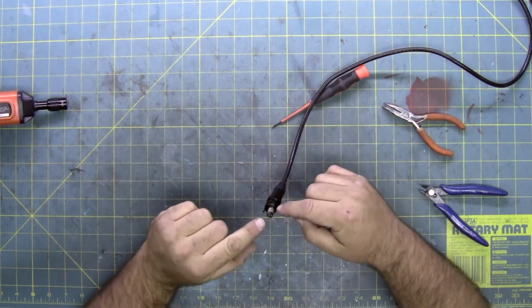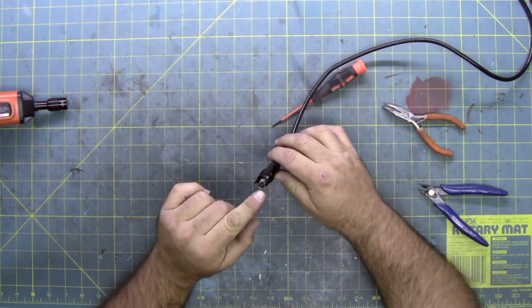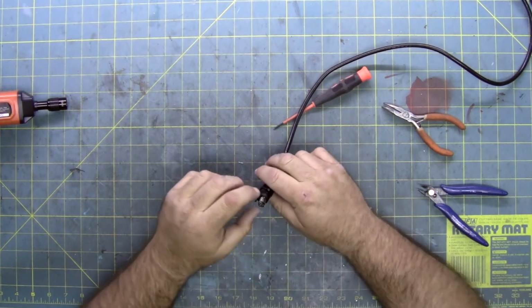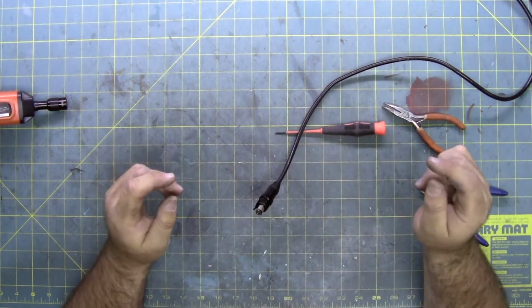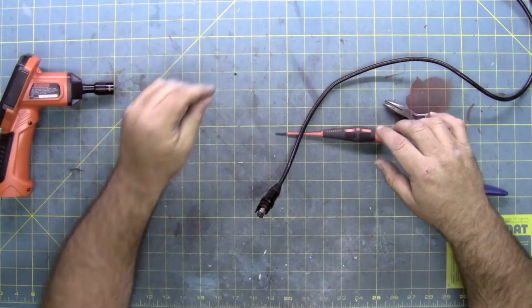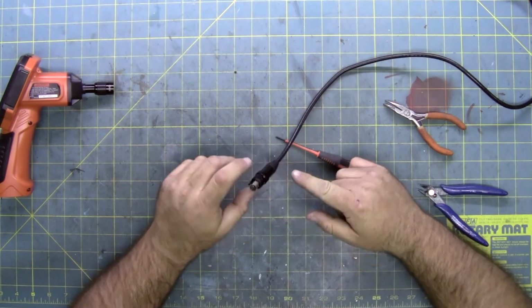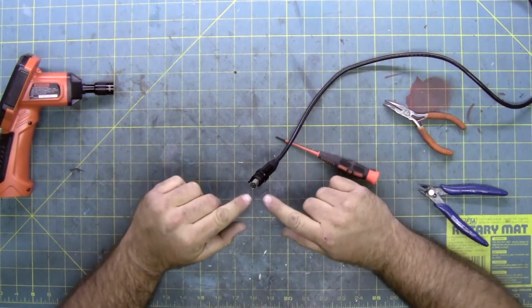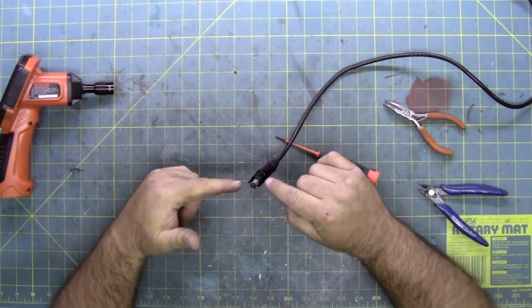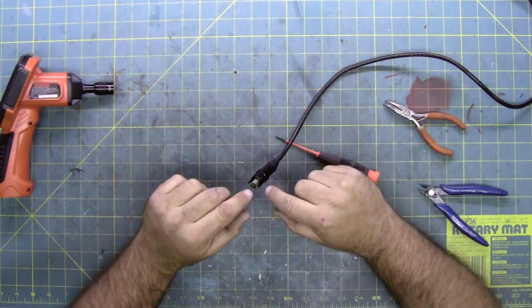I thought about taking the guts out of an old S-video cable, because they do look very similar, and trying to resolder, but I'm going to see if I can just replace the broken pin. And I don't want to lose that since it did fly across. Also, by taking it out, which you don't have to do, solder requires heat, and this is a big heat sink, so as you're touching the edges, it's going to dissipate the heat of the soldering iron.